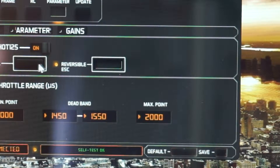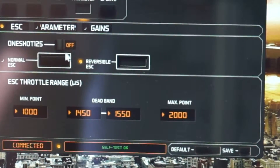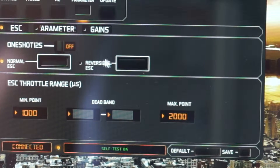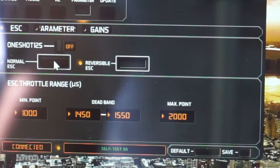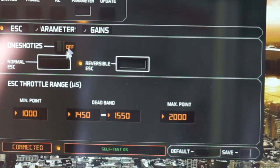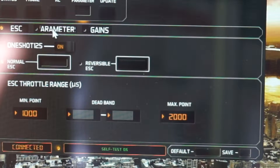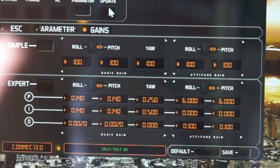In parameters, OneShot — I know you have to have it on because I kept testing. You can turn it off and go to normal ESCs, or you can go to reverse. But when you go to normal these cut off with the dead band. I tried reverse and it doesn't work — just beeps like you didn't even arm it. I tried an older Afro that wasn't updated and OneShot kind of worked but reverse didn't, so I was really curious about that. Probably not going to change any of these yet — just waiting on the ESCs.